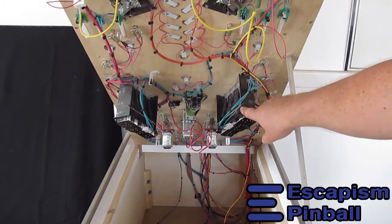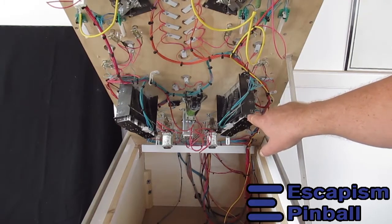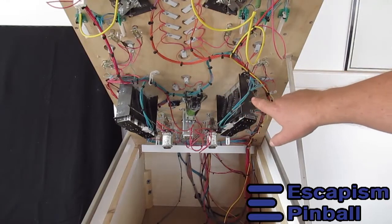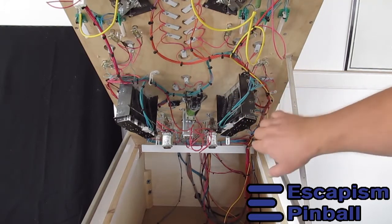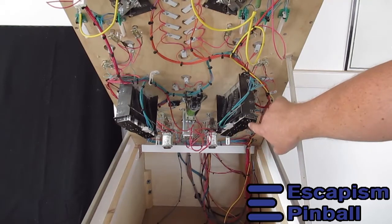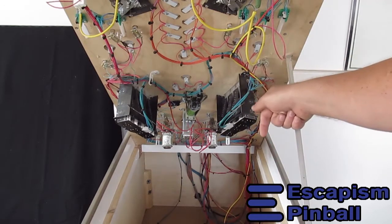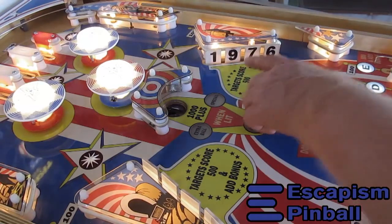They're drop target cassettes. And to fiddle with the drop targets on these is very easy, because you just unhook the drop target spring and you pull it out. You don't have to disassemble the unit, you don't have to unscrew it. The target switches are sitting on a little board here, and they're also micro switches that when the drop target goes down, it pushes on the switch. It's as simple as that. What I'd like to do is to change that drop target.